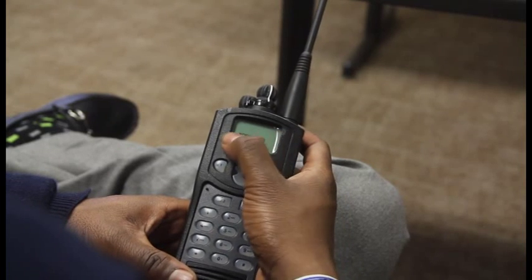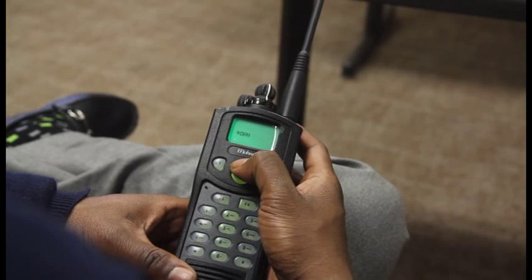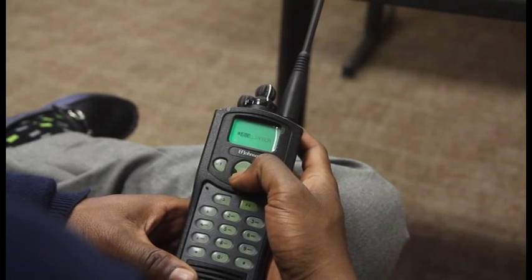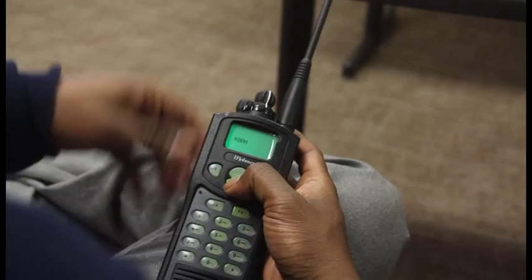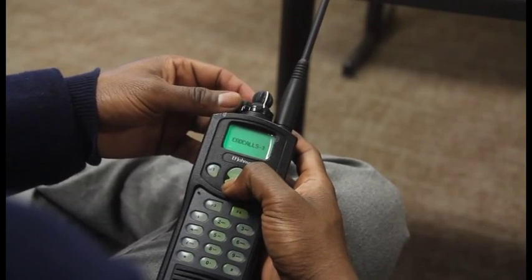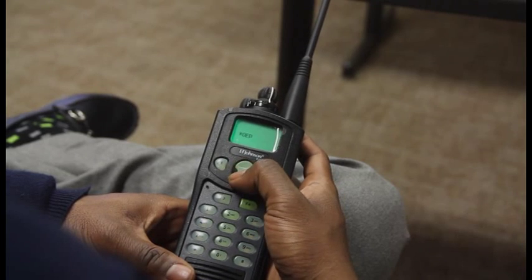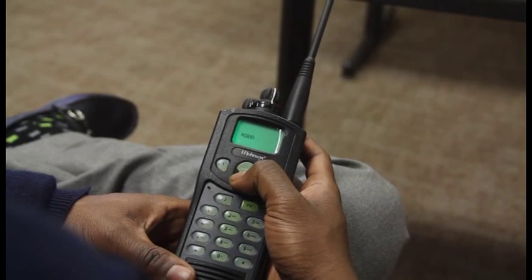As with the Motorola radios, the 700 MHz channels and zones will have the star symbol before their name. The 800 MHz zones will not have the star, and the message will change to out of RNG. There is not a full space for the full word range on the screen. As with the Motorolas, change the zones until you are back to a 700 MHz one.